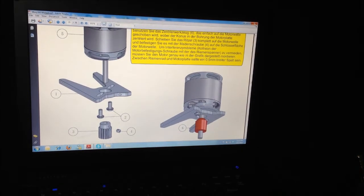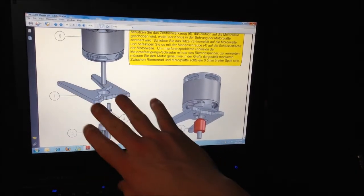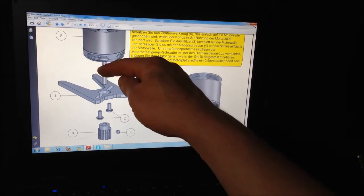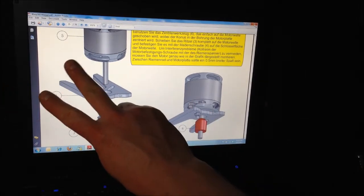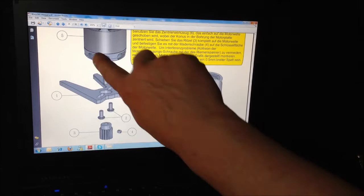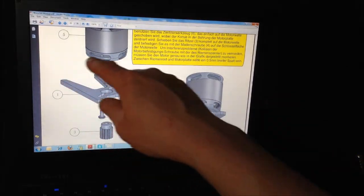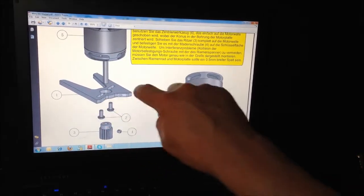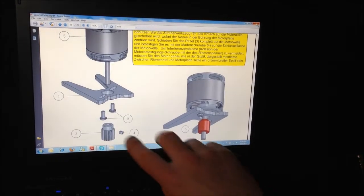Okay, and now on to the next step here with the motor mount. We're just going to, as always, make sure everything's lined up to look exactly the same as the picture. I'm going to have it so the wires are coming out this way, the motor goes on the back, and these forks go forward, and there's going to be a lot of electronics here. We don't want the motors to be poking into those, so wires are probably going to come out this direction and then route around to the front where the ESC is. So make sure the motor wires face out towards this direction, not towards where the two prongs are sticking out.